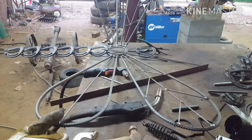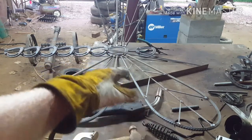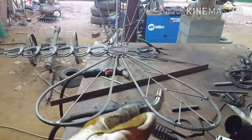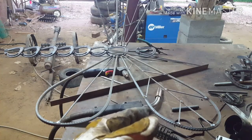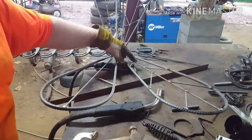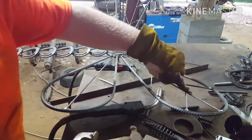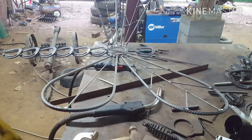Then I put these center braces in and then I done one wing. What I did was I measured - I got it looking how I wanted and I measured up everywhere I started, trying to get close to the same angle. It ain't exact. But I wrote it on my desk so I know: first one's five and a half, ten, thirteen, seventeen and a half, and twenty-one and a half. And that's one down here. Just try to keep the same angle.